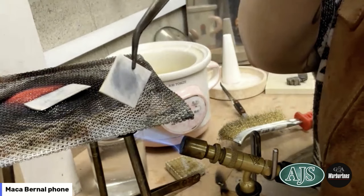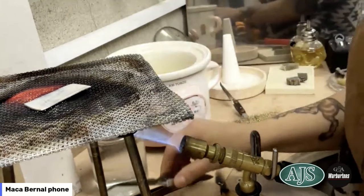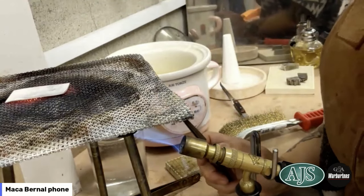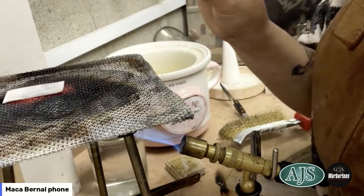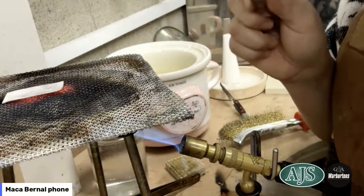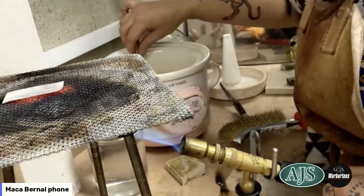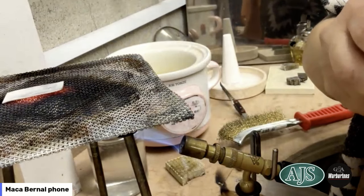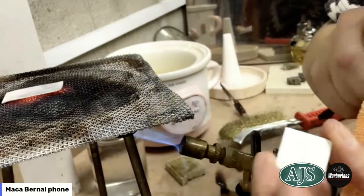Please let us know any questions in the comments. A little bit of oxidization on the first layer — quite dark — goes straight into the pickle for cleaning. This piece of silver that's now ready for reticulation is nice and white with a clean surface. The top temperature is only 650 degrees — we can't melt it, we can't take it any higher than that.